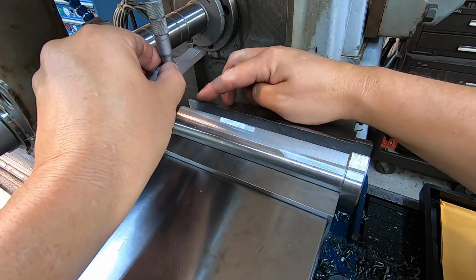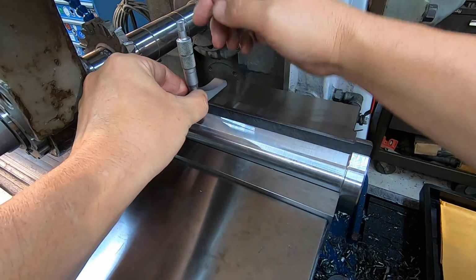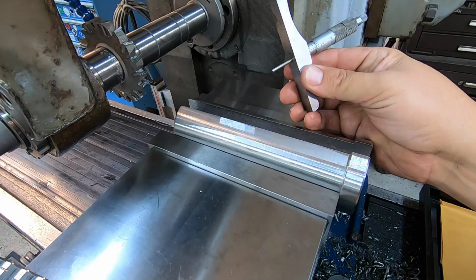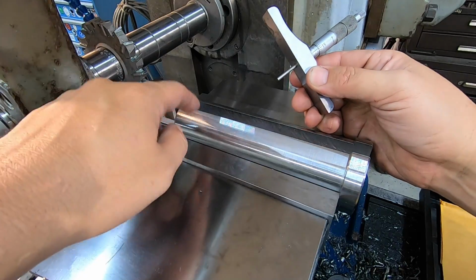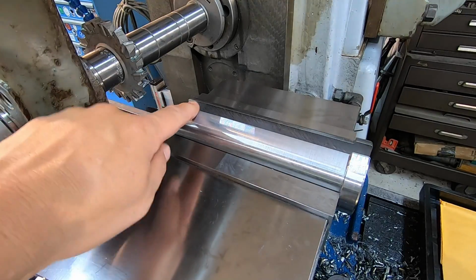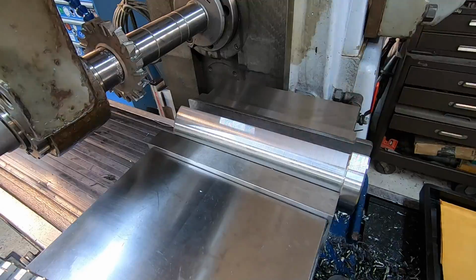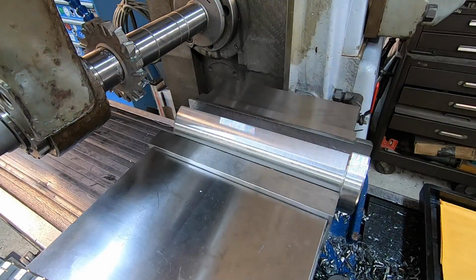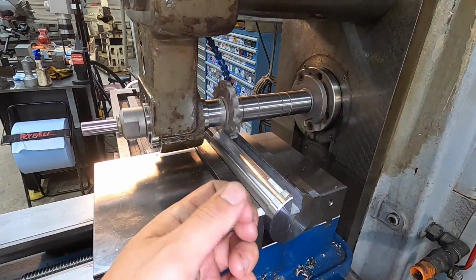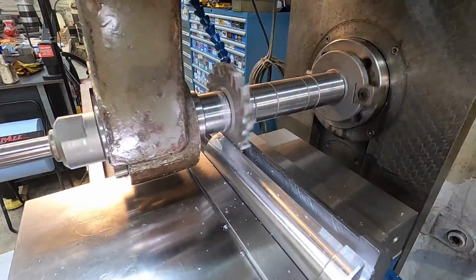And then I'm going to check the depth where it sits right now. Make sure the bottom is cleaned out. So it looks like I have gone 2/1000ths over the depth that I was shooting for, which is going to be just fine. We know that the cutter should slide down in there and start cutting properly. So one more pass down this side, 2/1000ths, give our clearance, and we should have this plug ready to go. Ever so slightly on that one side.